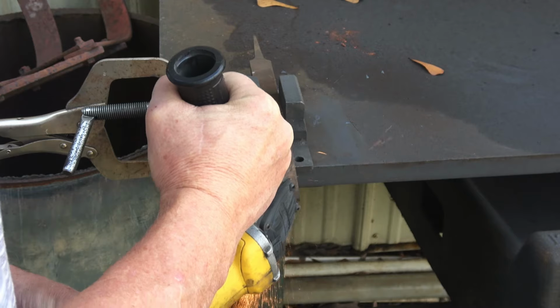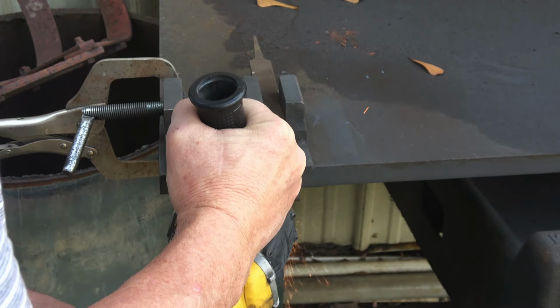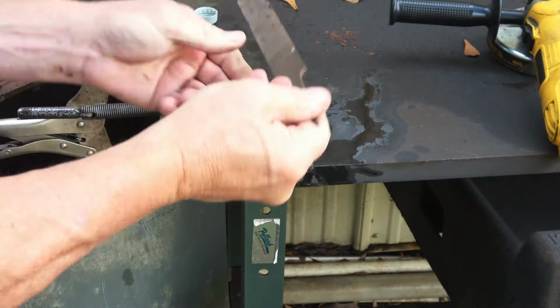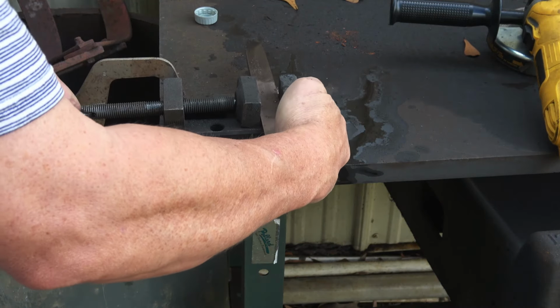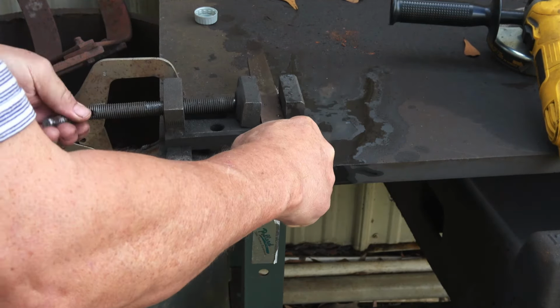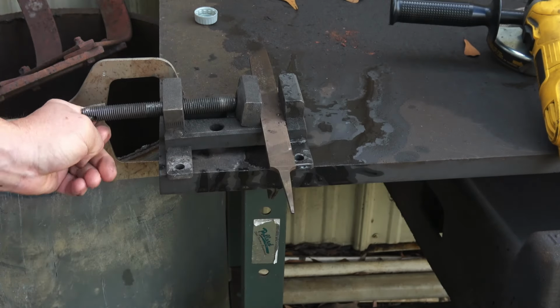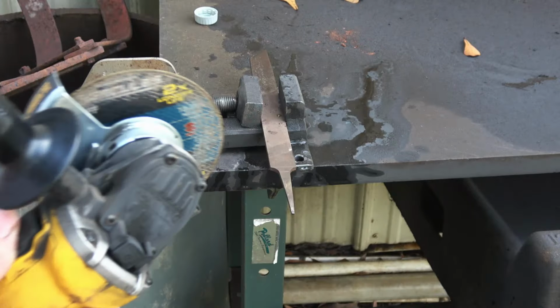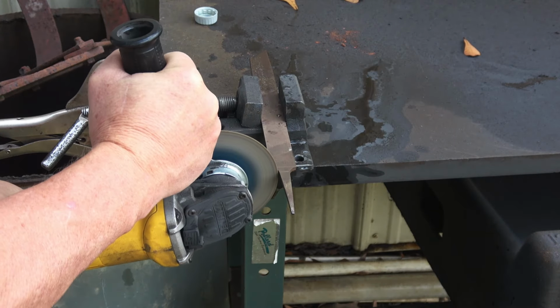We're gonna be using fresh discs to do the cutting and profiling and the bevel cutting, and I'll be cooling it with water. Now I do 99.9% of my grinding after heat treat anyway, but I'm running on a 2x72 where I can control the speed, run it slow with a fresh 36 or 50 grit belt. I can keep that blade cool. I don't ruin the temper.